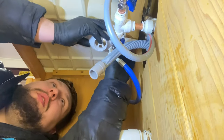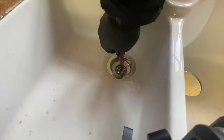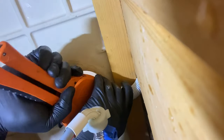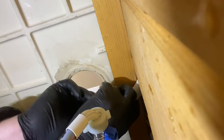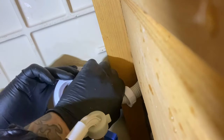Luckily because these were like-for-like Macalpine, the overflow kits we haven't had to get up there and try to replace those. Just push them in, make sure the rubber sits in nicely — everything should just sit in where it needs to. You don't need to force anything. On the other side the overflow was just a little bit longer and because it sags, food and rubbish will get stuck in that dip and cause a bad smell, so we're going to cut that back so it's as straight as possible and runs downhill.